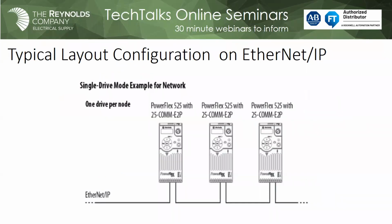So I've mentioned several times that all the 4-class drives and the 5-class drives have a DSI port, and they support multi-drive configurations. This is something that the 7-class drives do not, so this is kind of unique to what we have on components. In this graphic, what you see are the 525 drives, and this happens to be a DLR. I wish it showed a star topology, because a lot of times drives in cabinets are done on a star topology, which means each drive has its own Ethernet port in the switch. And as you know, there's a cost to each of those ports when you have to size that switch for your enclosure. So this allows us to control more than one drive off of a single Ethernet port. Okay, Mark?